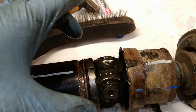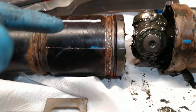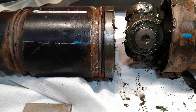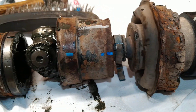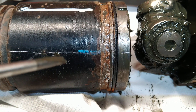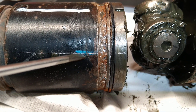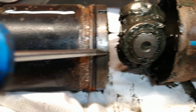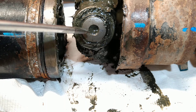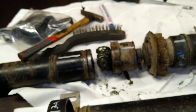When you take it out from the shaft, you need to make marks. I make a mark with a white or blue color marker, and the best way is to use a sharp element to scratch marks here, so you know how to put it back together.